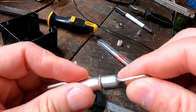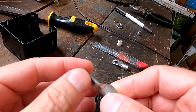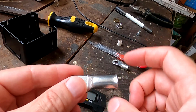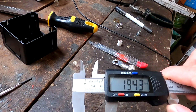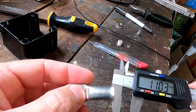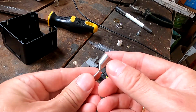Look at this — this one almost fits in there. I found some of these on eBay which I've already ordered and they're not coming from too far away, so they should be here in a couple of days. They also have this bevel mouth so you can easily fit the cable into the shaft, and the shaft is a lot longer. This one is 20 millimeters long while this one is only 11 millimeters, so almost twice as long. I can crimp these ones twice — that's what we did in the switchboard company — giving a really strong and sturdy connection. But this one is just a toy; it's not suitable.